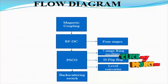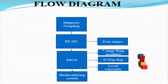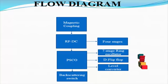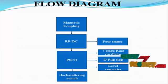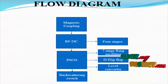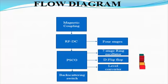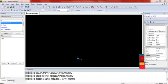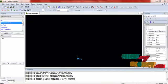Two NMOS transistors are connected between the terminals of the inductor. Their lengths were kept at their respective minimum values to decrease the on resistance, while their widths were designed to keep the on-off amplitude ratio higher than 10. Other transistors were used to tie RF plus and RF minus down to ground, aiming to decrease the on resistance of the main switch. Next, we are going to see the output for our product.